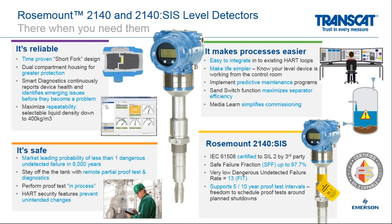The only catch that we want to be aware of is if you are replacing a float level switch and you have a float level switch that requires no power. Typically, standard wiring is used on float level switches. Because this is a digital instrument, we would want to use the same type of twisted shielded pair of 4 to 20 milliamp wires as you would use on any other pressure transmitter or temperature transmitter. Great question.